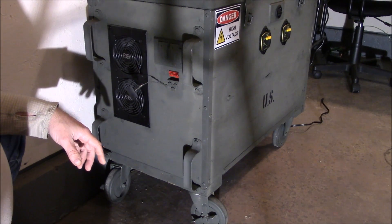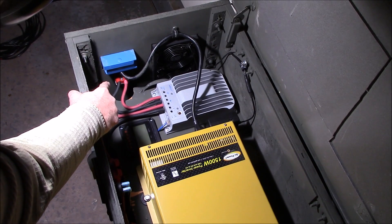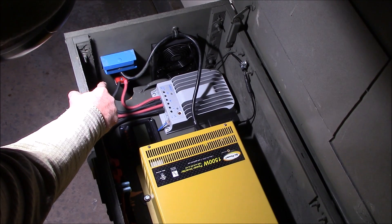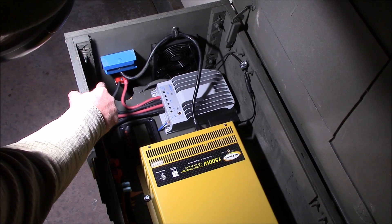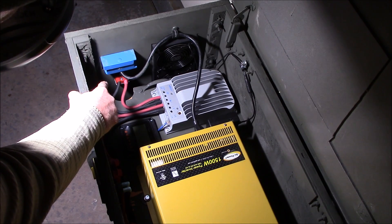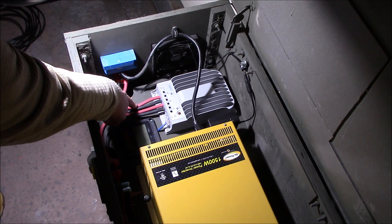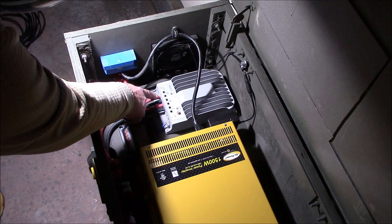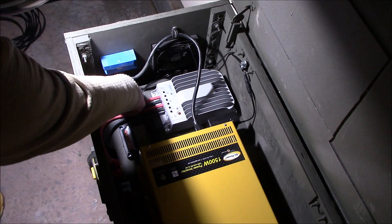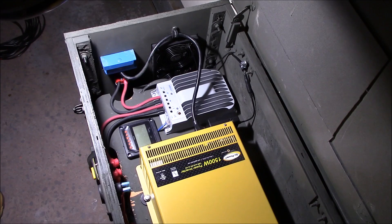Let's take a look on the inside and I'll show you some of the wiring. I'm holding this shop light here so we can see what's going on. I used some screws and small nuts on that L bracket, and then I bolted the L bracket with the Anderson connector onto the box with quarter-twenties and with the lockable nuts, so don't have to worry about it. Then I shortened these wires here to fit into the solar charge controller and tinned the ends to make them fit perfect. I also had to cut out a little half moon here so I can get the power tray lifted in and out without banging on these wires too much.